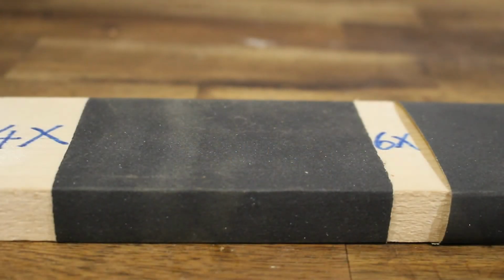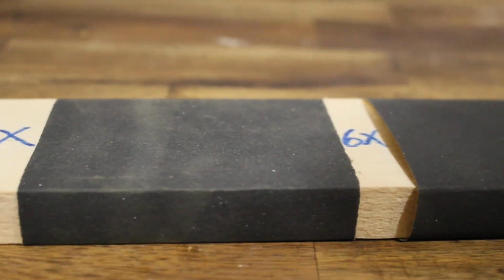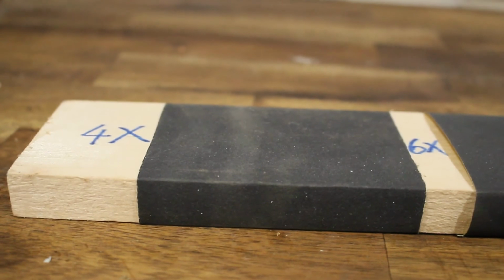Use some spray-on adhesive and mount your sandpaper, preferably several grits of increasing fineness. Once this is done, get your tool and check to see what angle it's sitting at. What you want to make sure of is that the faces of the cutting edges are going to be kept at the same angle or as close as you can manage. The inner surface should be flat. The outer surface should be curved.